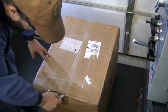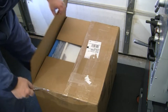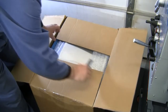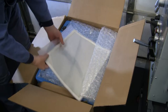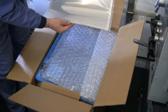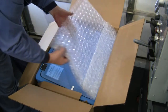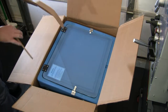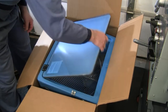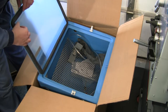This is their E100 LTC model. It should have a small pencil wand and it's only going to run about three cubic feet per minute of air, which is good because my largest compressor only puts out five CFM — so this should be sustainable. I also ordered 12 extra mylar covers for the glass to keep the window in good shape. Pretty simple packaging; the whole thing only weighs maybe 25 or 30 pounds.